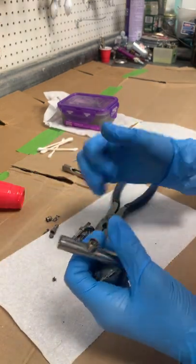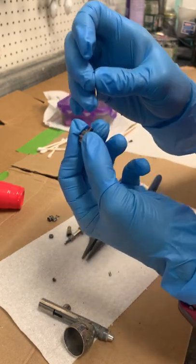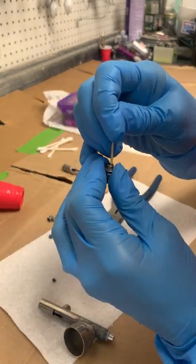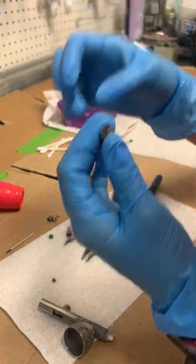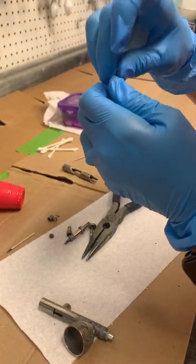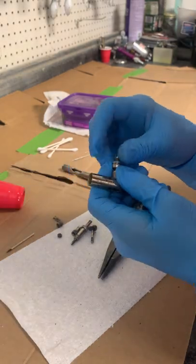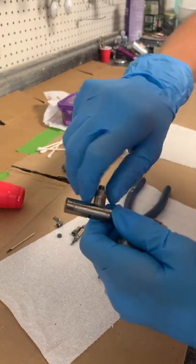Now put back the plunger mechanism — take the plunger body and put it in tip-down toward the long side. Push it in with a toothpick until it's seated and sticking out the end. Then take your tiny spring and drop it in on top, then take the tiny gold cap and screw it back in tight — when you use quick disconnects it can pull that cap off and cause you to lose your spring.